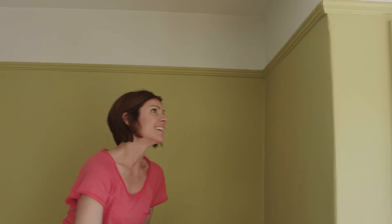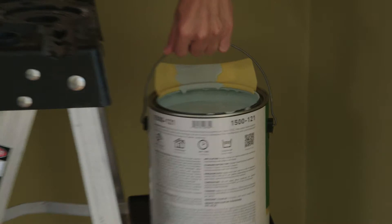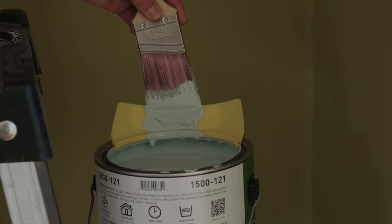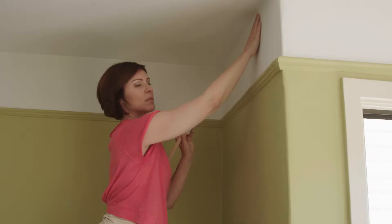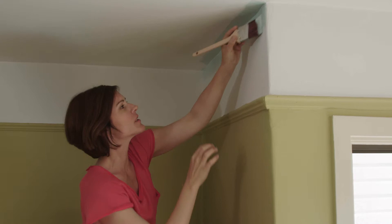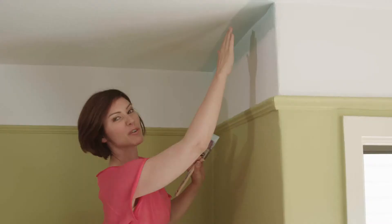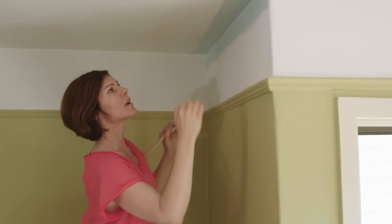The first step is cutting in. I'm going to dip right out of the can and I like using these visors because it keeps the edge of the can nice and clean. I want to paint along the ceiling and also along the wall and really get in this crease here. The important thing to keep in mind when you're cutting in is you want to feather this edge or just kind of soften that line. Don't leave a ridge because you'll see that when you roll over it. Just make nice long even brush strokes and feather that edge. You want to cut in about at least 3 or 4 inches onto the flat part of the surface. That way when you're rolling the paint you come as close to the corners as you can and you get a nice even surface.